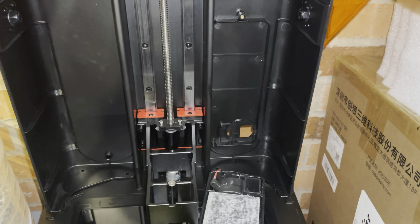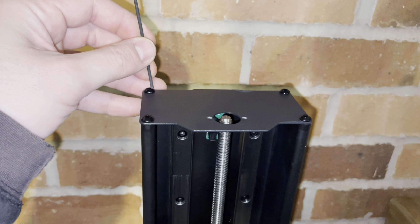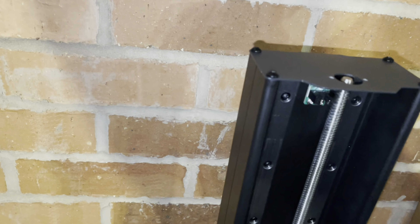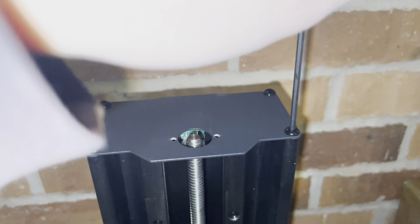That reveals the top part of the printer, which should now be very easy to fit the parts. First, just put the plate on and use the four black bolts to secure the corners of the plate. Using the 2.5 millimeter Allen wrench, tighten them up. Don't go too hard on these bolts — they strip very easily. Just make sure everything is snug and you don't have any wobble.